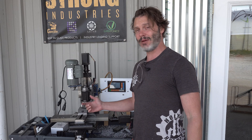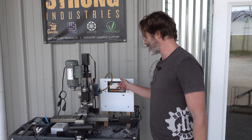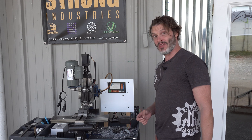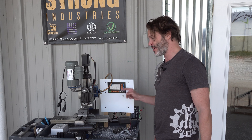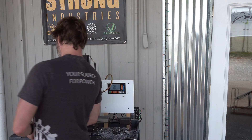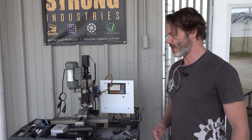Right now I've just got a little aluminum ring buried up in these jaws — clamped it down. Now we're boring them out. Unfortunately, this little CNC controller is of the caliber and quality that I just cannot seem to get things right, so I'm actually just manually stepping this thing a tenth of a millimeter at a time. This is kind of hack machinist work, I'll just tell you right now — but it works.